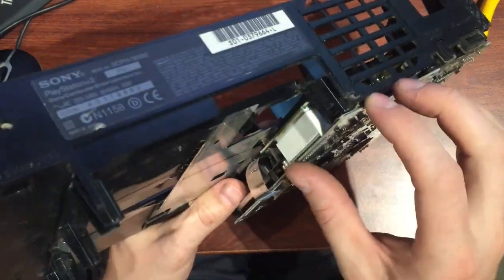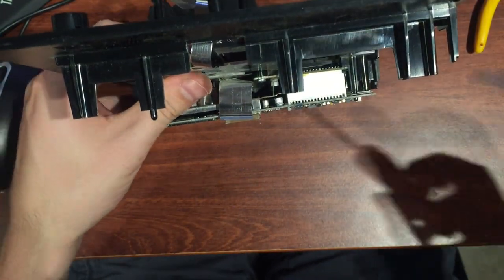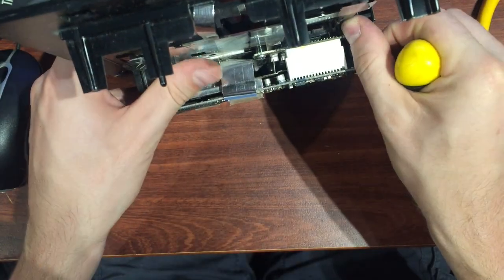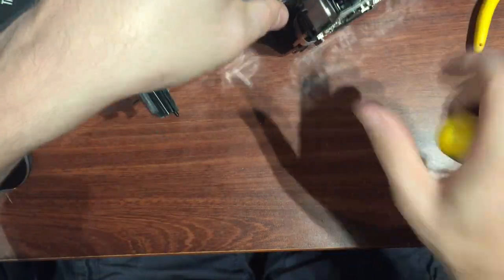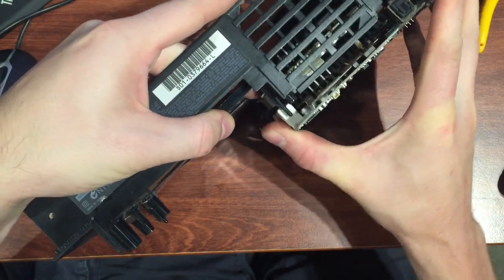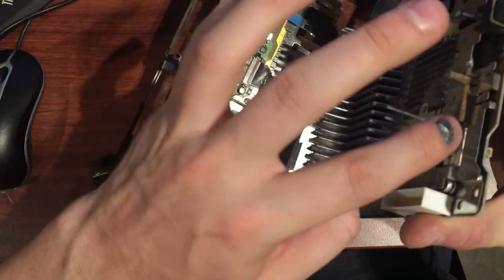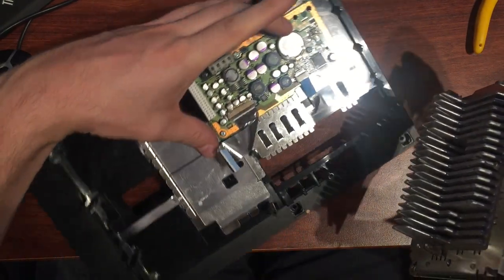What we have to do is wedge the board off these connectors. Just pry it gently with a screwdriver — a bit of pressure and they'll start to come apart. Then you can wiggle it and the whole thing should just come apart. There you go — that's what was holding it: these long pins into that board. And there's a CR2032 which we may as well replace while we're here.